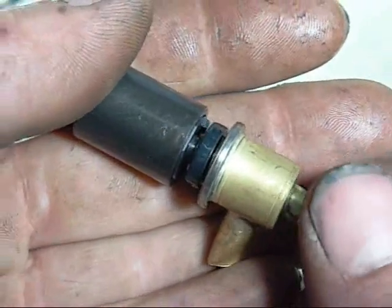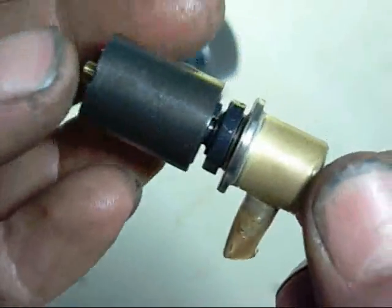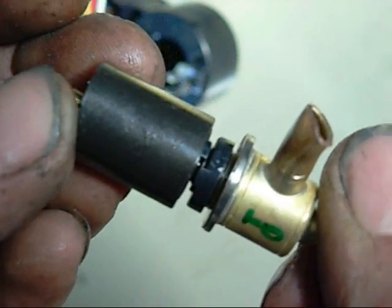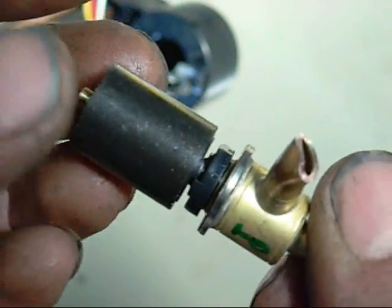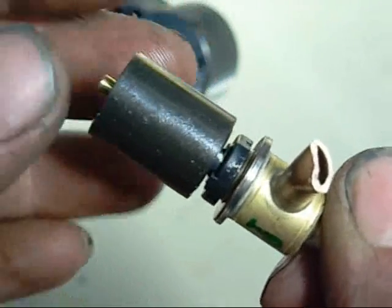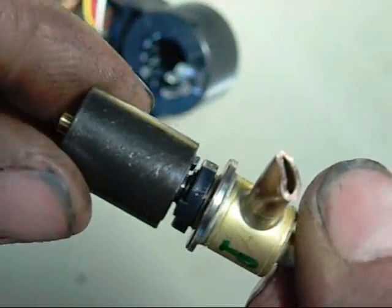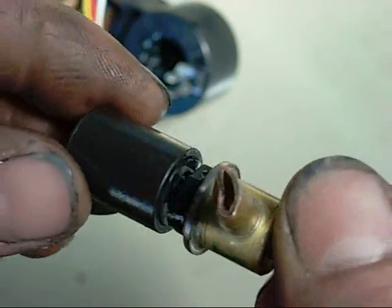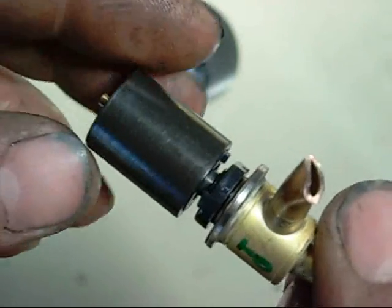Just a closer look at this little valve assembly. That's its home position — it won't go down any further. So the unit started up, it's wound it back home. Now when the unit starts up it will tick it over and unwind it so many turns to release refrigerant through the discharge side.